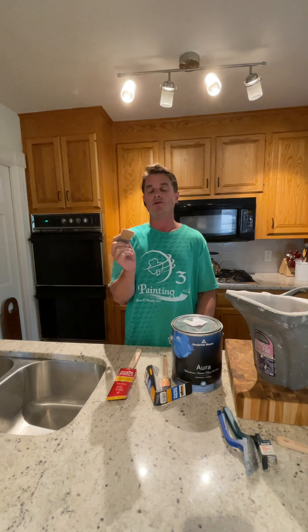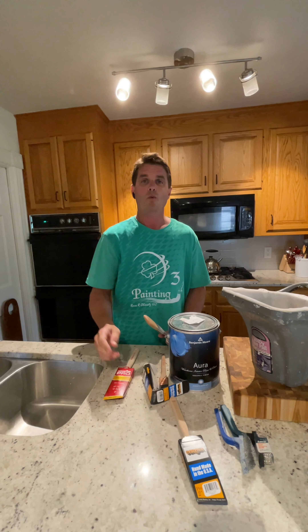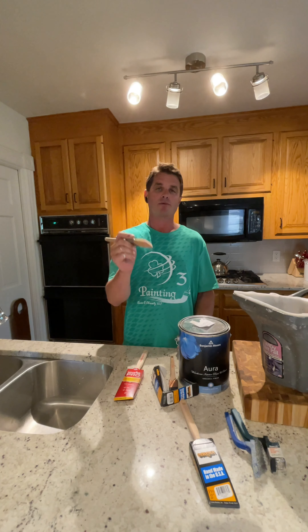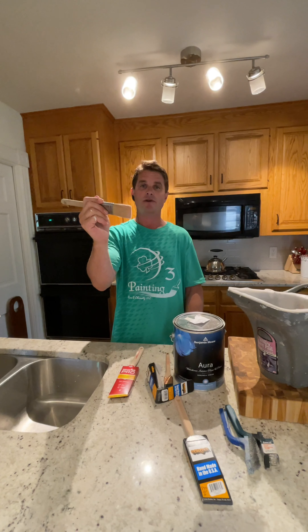You're going to try to get that roller within a quarter of an inch. So there's no reason why you really need a huge brush. This two-inch brush here is the maximum width you should use to cut in, because whatever you can roll, there's no sense in using a brush to cut in even wider than this. This is an inch and a half.